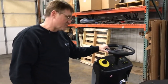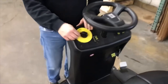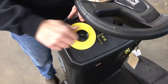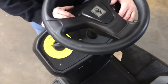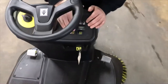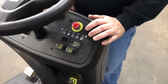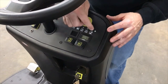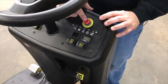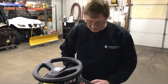Like all Karcher pieces of equipment, anything in yellow are touch points. On the dash, you have a dial that indicates just move mode, brushes, and the outlet brushes. You have a forward and reverse switch. You have a shaker — when the filter gets dirty, you press that button and it will rattle the filter for 15 seconds so the dirt falls down into the collection bins. You have a horn, an hour meter, and a bunch of LED lights. Then you have the emergency stop — some people call it the kill button — where you push it in and it kills everything. To release it, you just pop it up.